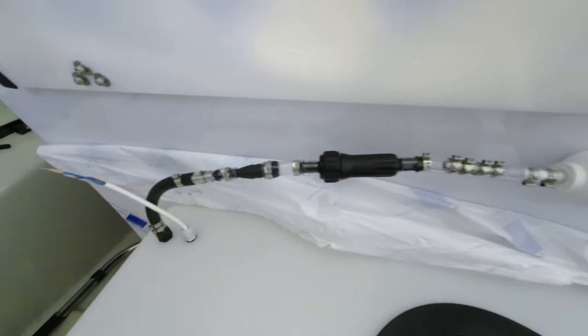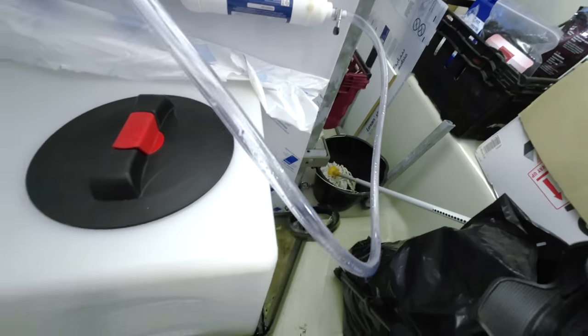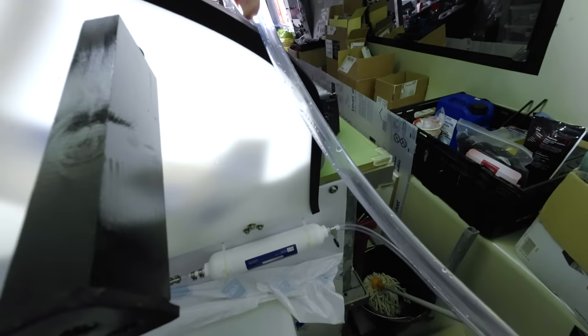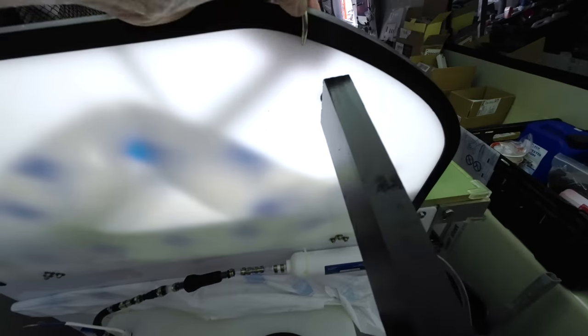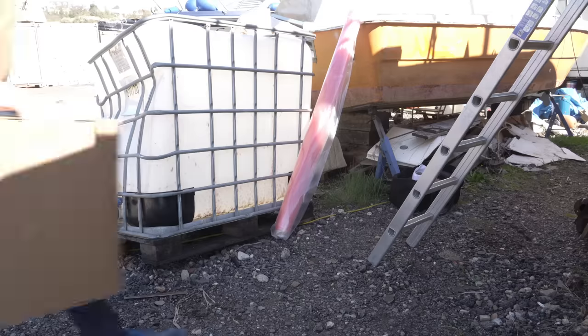And I'm going to run the final length of hose around the side of the worktop and bind it to an adjustable stay-put gooseneck. I've bought the gooseneck, but I'm awaiting the correct 5/8 ultra-fine thread nuts that will help secure it to the worktop. I also need to run a proper fused 12-volt supply down to this area and screw in a sort of tie-back to hold the worktop vertical when I need to maintain things or access the tank's top hatch. I won't fill the tank until we're ready for the off.